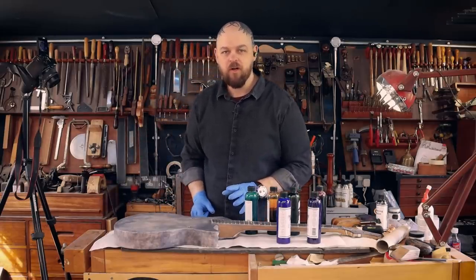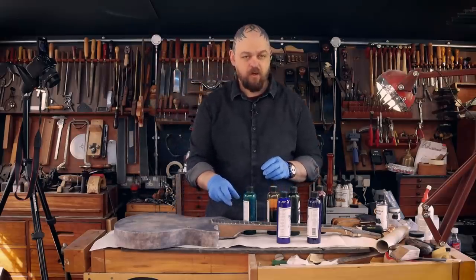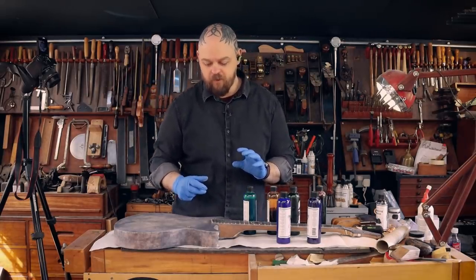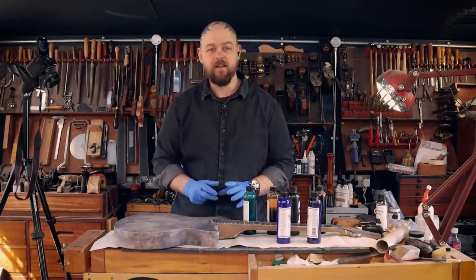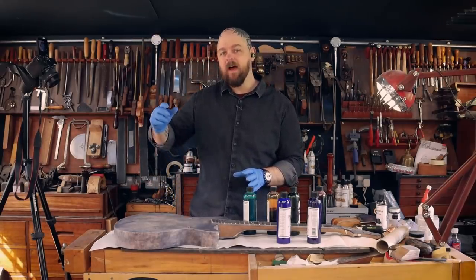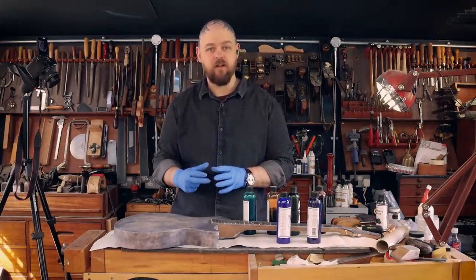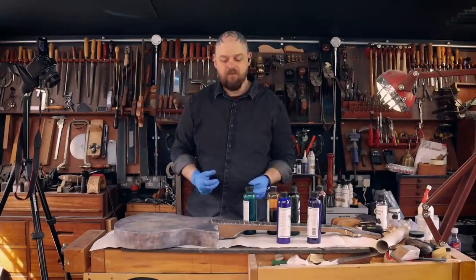This is going to look terrible in progress. It is then going to hopefully look amazing. I am applying stain. I am then going to sand it back a little bit after I have applied various little pieces of grain filler. I am not worried about filling the largest cracks and cavities. The plan is that we are going to fill what we can and apply lacquer and all of that jazz. And anything that is larger and is not properly filled is going to be essentially painted a matte black to emphasize the fact that that isn't shiny. And it's going to add even more character to the reflections and fun stuff going on.